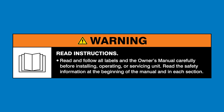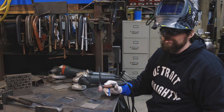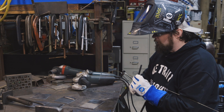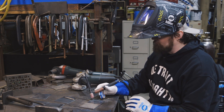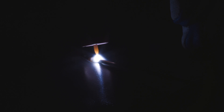Read and follow all labels and the owner's manual. Right now we're going to do some silicon bronze beads. We have the welder set up just like we would weld stainless steel or steel on DC. We're going to show you how to kind of start the bead going — it's not a traditional puddle. You're not melting the base metal; you're just getting it hot enough to take the material. You can see some heat forming on the surface and you just dip the rod into the leading edge, making sure to keep it within the protected zone of the gas coming out of the cup.